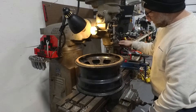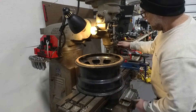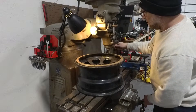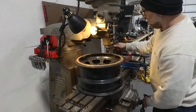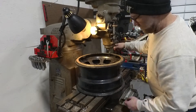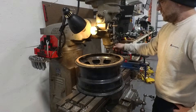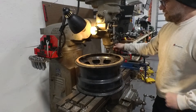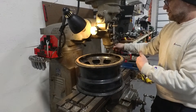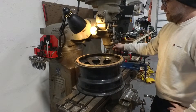So we'll go back down here. We're going to loosen up our Y, go back down to that hole, and go ahead and tighten that back down. That's why I love these cutting bits, these end mills, doing something like this — if you do that with a drill bit, you're done. But with a milling machine you can go back and forth and let it cut back over and get back on center. One trick — we were close enough we could have just gone straight now, it's still a bit okay.